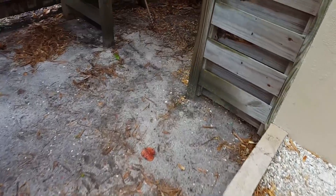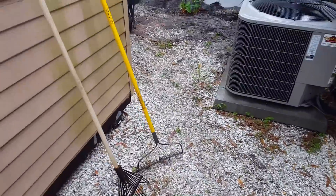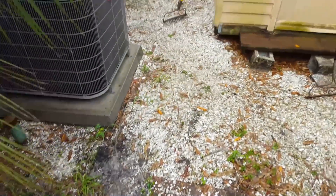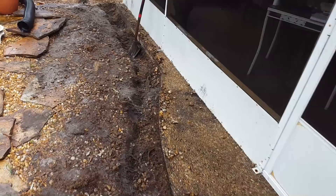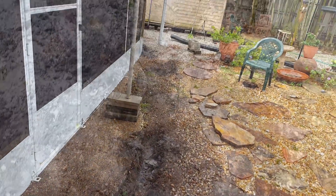Next we're going to go around here to the back to see how far these guys are on their part of the installation. We still need to trench down through here — this is the discharge side coming to the sump pit and sump pump. They're still wheeling soil but looking good. We'll come up out of there with inch and a half and then switch to two inch, come around the side of the house and join up with my trench leading to the pop-up. We have to move this soil out of the way because we're replacing it with our peanut pipe — easy flow — and gravel perforated, following the contour of the deck.